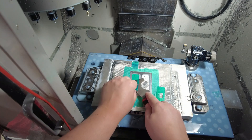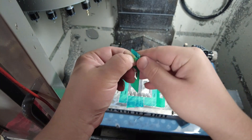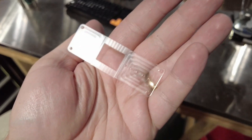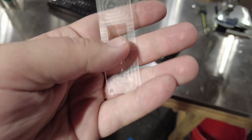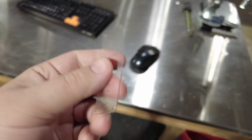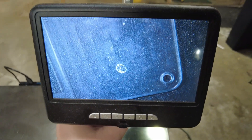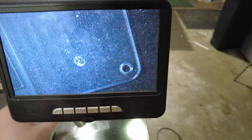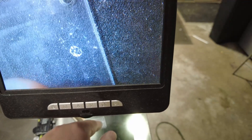From there I take off the protective tape layers. It's a little hard to see, but this is our finished part. It's not optically clear, but it's definitely acceptably clear for any application that isn't precision optics. Looking at it under the microscope, the finish looks pretty good — all the holes look fine, deburring looks good enough. I would call this a win.